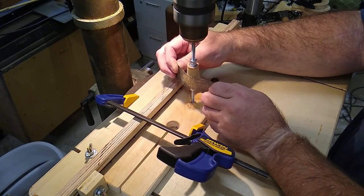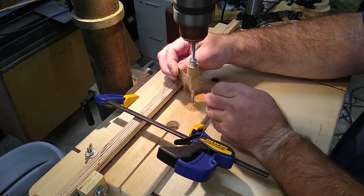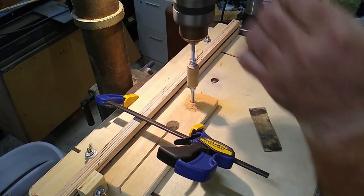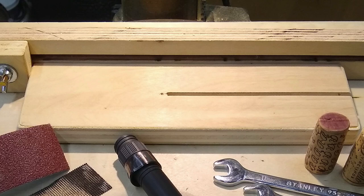What this two-in-one jig will allow you to do is fairly accurately drill your center hole through a cork, and it will also allow you to turn down the outside diameter by sanding. To make this jig, I'm starting with a board that's been cut down the middle but not all the way through — I cut this on a table saw. You could cut a slot in a board with a hand saw. I'm using a piece of three-quarter inch plywood, but you could use pine or any type of wood.